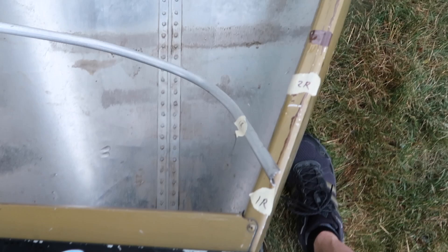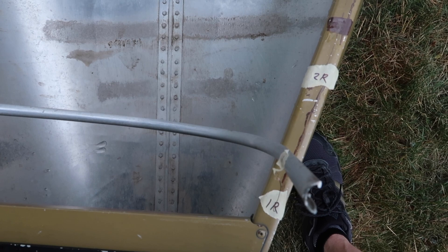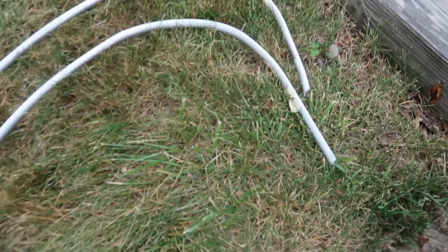I don't personally know if flipping it matters, but I just want it to be as easy as possible. For instance, this liner here has a '1 R' on it - that R means this side of the bracket came from this side of the canoe. If there's any irregularities in the bend, I don't want that to make my life any more difficult. So put the tape where the ribs came from, label them so you're putting in the right rib, do it all the way down. I have all my ribs with masking tape and labels, and I'm going to get started putting in the liner.